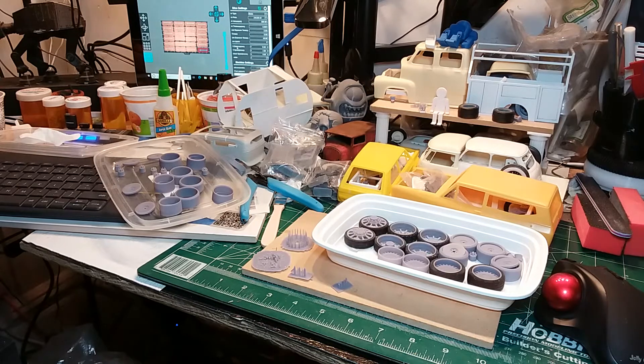You have to play with the settings just like you did with the settings on other 3D printers. Because if you don't, you're going to waste a lot of material — and resin wastes way more than filament, way more than the other printers, the guys were telling me. So those are tricks you've got to play with. If you don't need a thick support there's no reason to use it. Use a thin support because it will hold the piece in place — it's not going to fall, it's not going to break off.